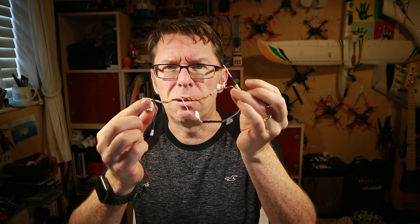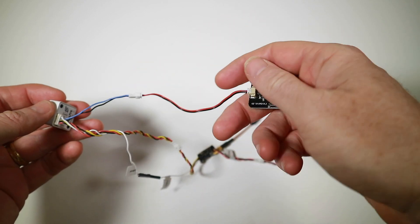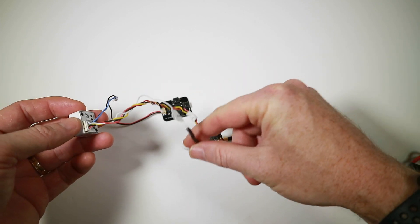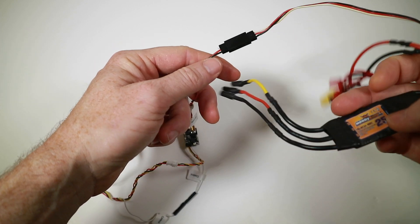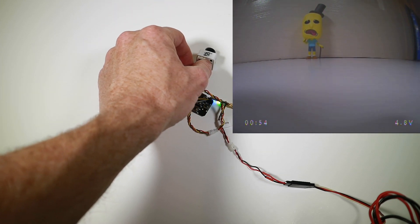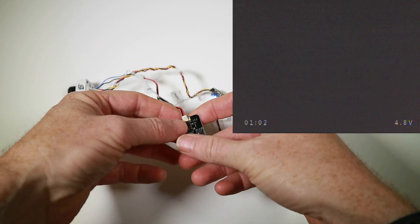So I'm going to show you exactly how that works now, but not here because you can't really see anything and I need to record the footage in some goggles. So join me down on the floor where we go into close-up mode. Okay, so what I've got as talked about before is the camera, and that's connected to the little OSD selector thing — and generally speaking if you were going to install this in a model that wouldn't be there. This comes down to this connector onto the VTX and then this special control signal one. What I've done here is I've hooked up the five volt supply to a servo cable which connects up to this old ESC. So just for the purposes of seeing stuff, there's Mr. Poopy Butthole there. I'm just going to put the lens cap on first off so we can go through the options through the little menu thing.